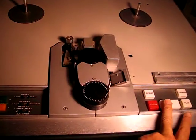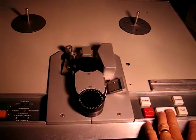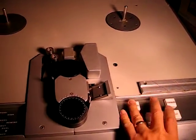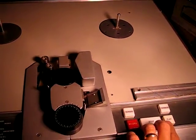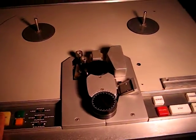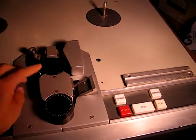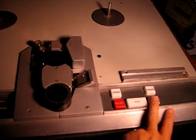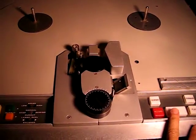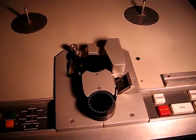Now we'll see what happens when I put it in stop. It doesn't always drop back into that initial state — now there it's locked in wind. The transport control is touchy. The only way I've been able to get it to drop out when it's locked up like that is to cut the power. Sometimes after pressing play, I can put it back into stop and then it'll drop back to where the reels are just slowly spinning in a holding tension.